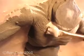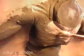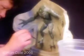When you start adding the plaster, your first layer to your sculpture, you brush into any deep details and along straight lines, in between wrinkles in your character or whatever, all the deepest spots, but you go into them with a very thin layer to be sure that you're not trapping pockets of air. At that point, your plaster should start to thicken up, and you can move to a bigger brush, adding on thicker layers.